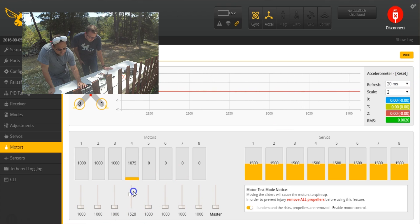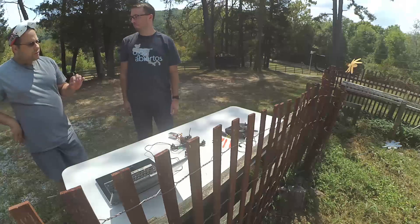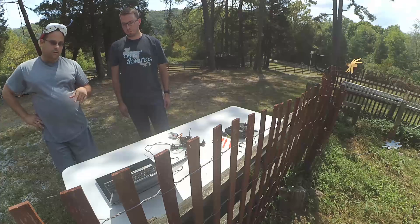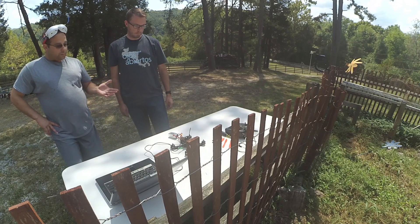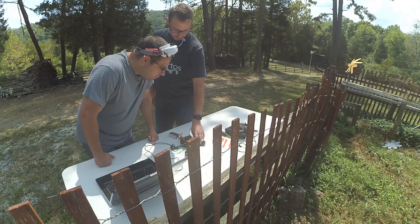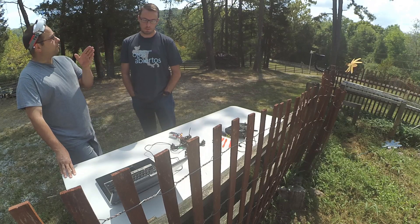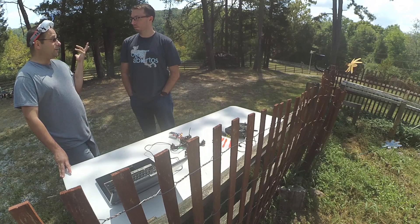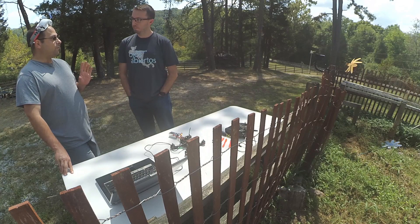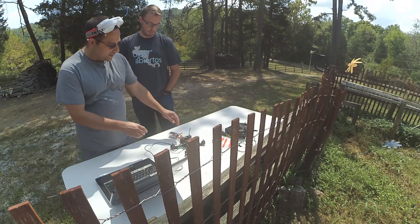That one's fine. And mostly what we're looking for here is — that one sounded different. That one did sound different and it's a little worse: 0.04, 0.04, 0.06. What we're mostly looking for is one motor that's substantially worse than the others. Now that one is not so bad that I would say it needs to be tossed, but it is notable that it's substantially worse than the others. We would keep an eye on this motor. Notice it's also the left motor — it's got some grass showing there, so it may have taken a hit. 0.03 and below is great. 0.1 and below is probably not even worth thinking about. And somewhere between 0.1 and certainly 1.0 you get to the point where if you're reading 1.0 you should probably scrap the motor.